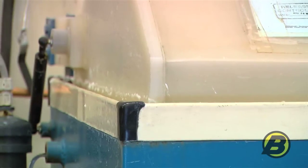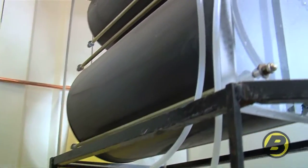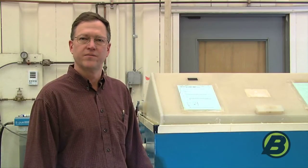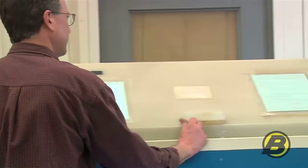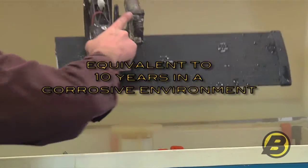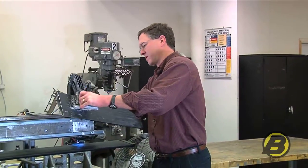This is our salt fog cabinet — it's an accelerated corrosive environment. We use it to test the durability of our products and the platings on the components, and to ensure our products meet OE standards. We also test aftermarket products in it, and we test beyond OE standards to failure just to see where the weak points are in our components. PowerBoards have been in there for six weeks, which is equivalent to over 10 years of corrosive environment. I'll plug it in to demonstrate that it still works.